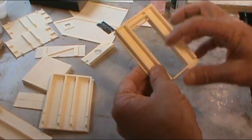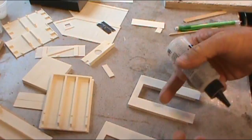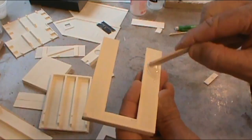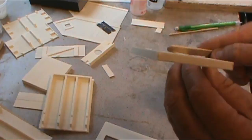This is very easy to do. I'll just take five-minute epoxy — we need to do it on the door first because this is smaller. You can see there's just a little bit — we'll get rid of the excess shortly. Just mix it up right on the part, make sure you get it mixed well. Then take this and just act like a spreader — all you need is a thin coat. It does not take much as long as it actually touches both sides.